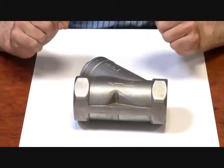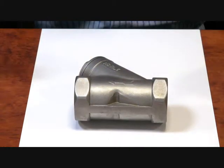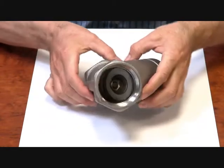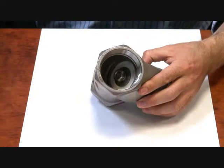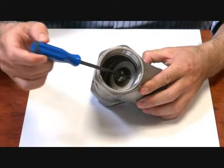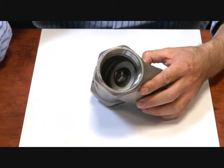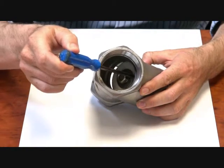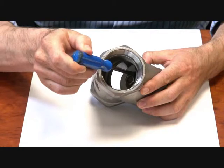The pressure it can take is up to 54 bar or 790 psi. Now, the way it operates — if you have a look here on its inlet, you can see down where I'm pressing the screwdriver is the seat. So you have your flow coming through, it hits the seat, pushes it up and then flows past.